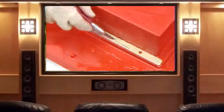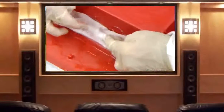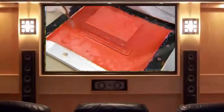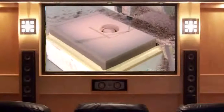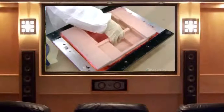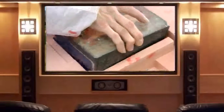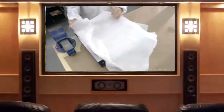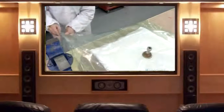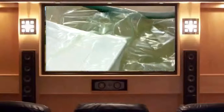Aluminum plates are embedded within the fiberglass to reinforce the area where screws will attach the cavity cover. A computer-guided milling machine contours a piece of foam that will fill the empty space inside the shell — this foam absorbs the force of impact so the flight data recorder can survive a crash. They coat one side of the foam core with resin paste and lay it into the mold, then fill voids with a temporary retaining block to prevent the foam core from collapsing inward. They wrap the mold in felt, put it in a plastic bag, attach a hose, and start the suction — over four hours the vacuum slowly extracts the air, drawing the fiberglass tightly against the foam core without any wrinkles or puckers.